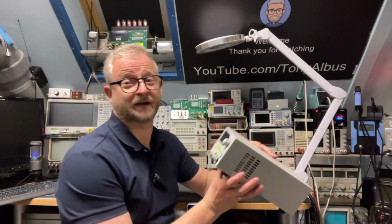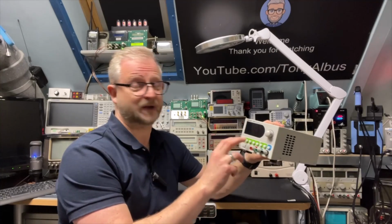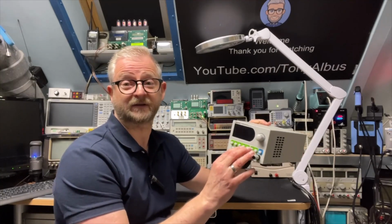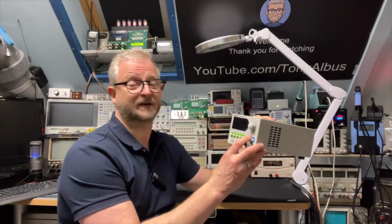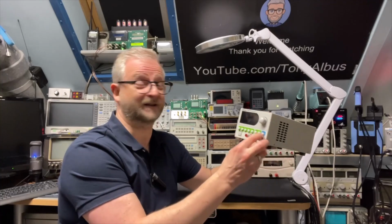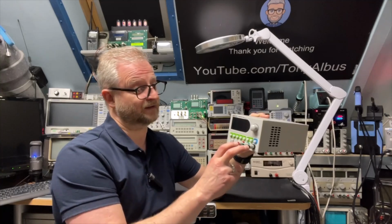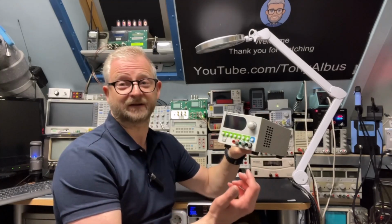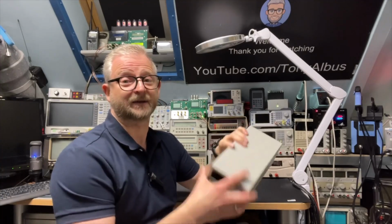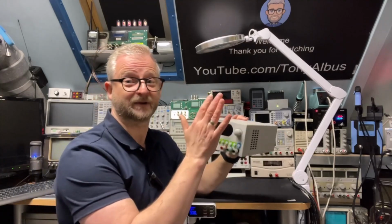I'm really amazed how easy to control the device is. It has the memories. It just works as you expect. I like that you can set the constant current or your maximum current. You can set it just by not having switched on the output, exactly as you would want it, so you don't need to short circuit the connectors for that. And the possibility that you can switch on and off your output, that is really great, and that I really missed on the power supplies I bought a few years before, and this one doesn't.